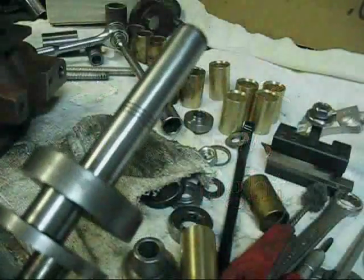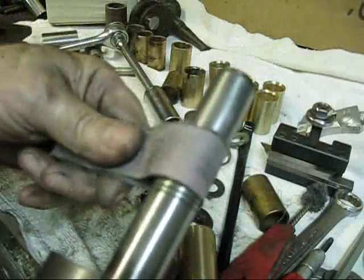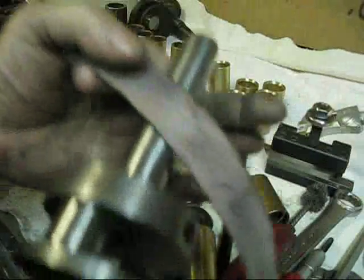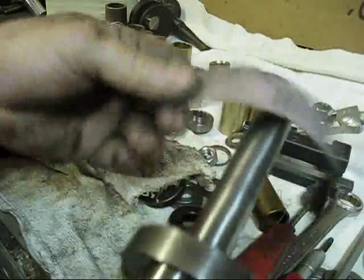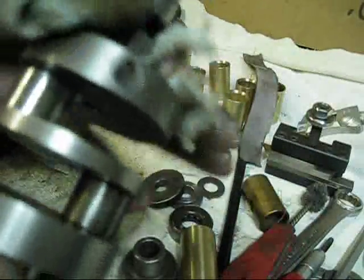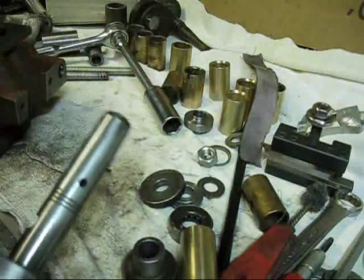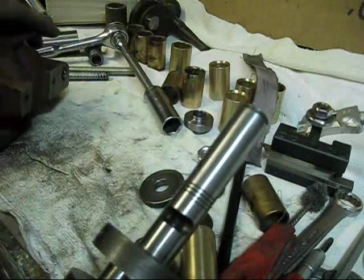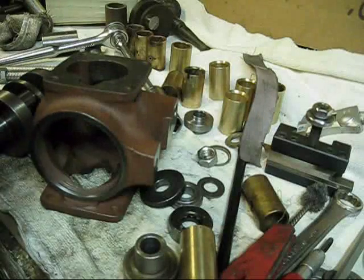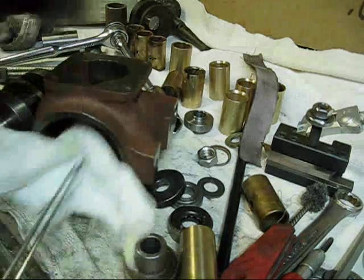What I've been doing off camera there is with this piece of emery cloth - all I have been doing is holding it in the vise and going around there, polishing this shaft right here. I've been polishing the file marks out of there. Now let's try it in the crankcase and see what we've got. First off, I should probably run something down through yonder just to get the dust out of there. We're not putting any oil on it yet.